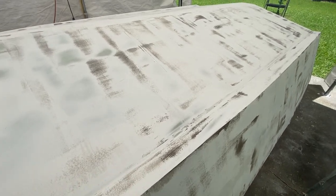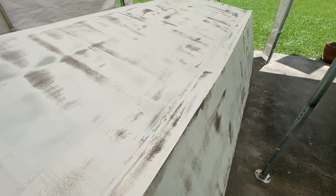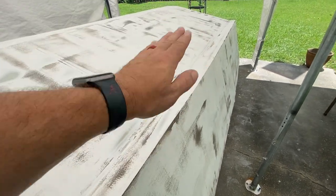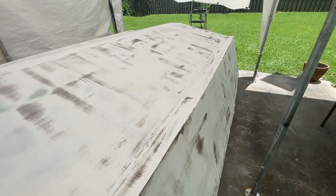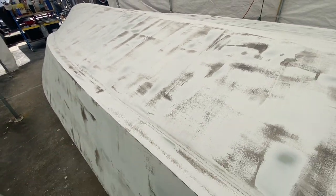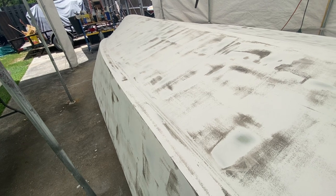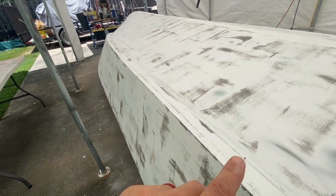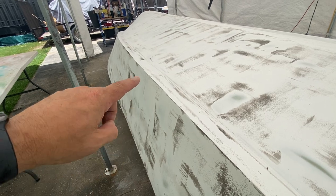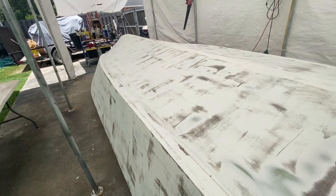I'm still, with all the work I've done on these chines, seeing some low areas, which goes with what I could see when I looked down them. I'm exaggerating, but they had some waviness to them. The guide coat shows me where those low areas are, so when I pull this fairing compound in there, it should be really good. But this angle here, this arc that comes down and goes around, looks, to the eye, just as fair as it could be.